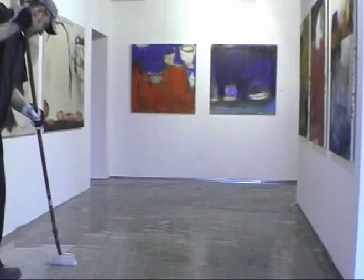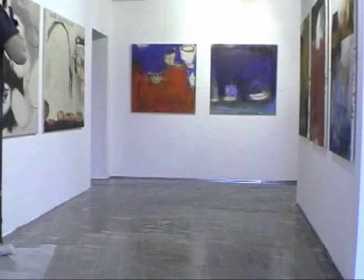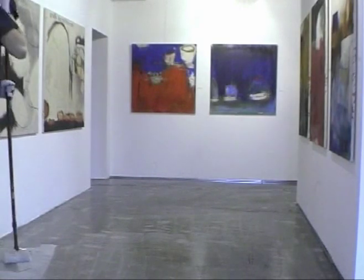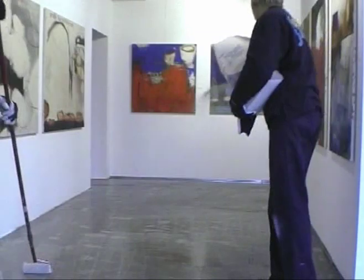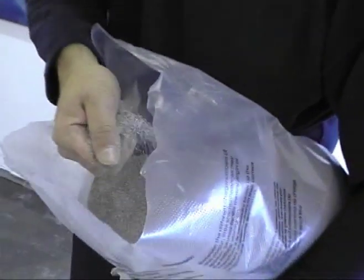In order to ensure the quartz granules do not slide during installation, it is advisable to spread dry sand into the wet primer before it sets. This process will assist the mechanical bond between the quartz and the subfloor.